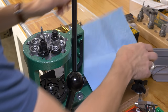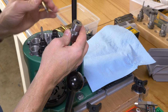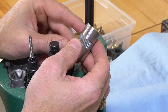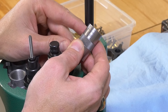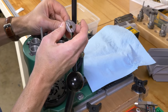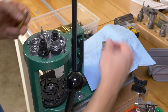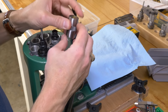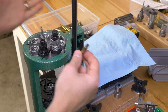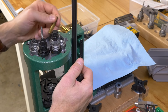I'll go ahead and wipe off the lube. This is a super critical part of the whole process: use your case gauge as your measure of whether forming has been successful. I've got the L.E. Wilson custom 25-45 Sharps case gauge here, and I can feel and see that we are flush or slightly below flush with the top step and above the bottom step. Comparing to factory 25-45 Sharps brass, our trim-to length is well within spec. With the progressive press, we can basically go through this process as if we were progressive reloading, adding a new case each time and having one kick out each time.